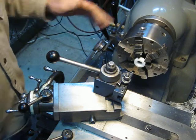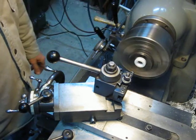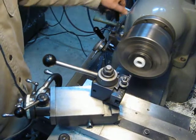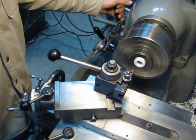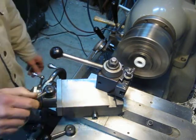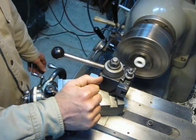Basically, there are two features the Hardinge has that other lathes don't. One of them is a feed reversing lever that you can use under power — most lathes you have to stop to reverse it, but the Hardinge you can just go back and forth all day long, it doesn't care. And the other is this tool retracting lever on the compound, to get your tool into the work and out of the work at the beginning and end of the thread.